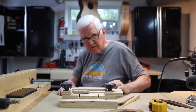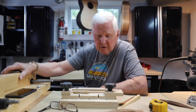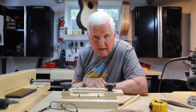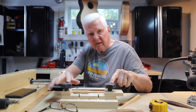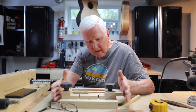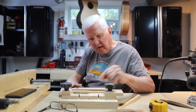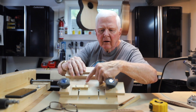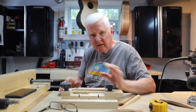It's a very simple, straightforward jig — it's not that complicated. I think you can do it. If you can build a guitar, you can build this without any trouble, and it's just made from scrap wood you've got in your shop already. So give it a go, and let me know — you'll probably come up with something much better than what I have. Don't forget, you don't need these knobs; you can just put screws down there. These are slotted on the side and they come in and out. The purpose of this is simply to stop the router at the 35 millimeter mark on one side and the 35 millimeter mark on the other, so it just doesn't keep on going.